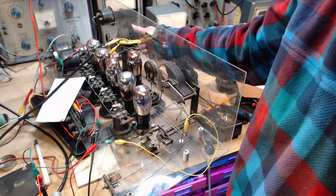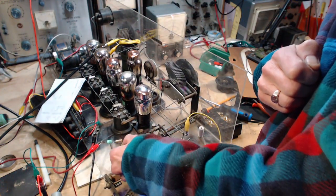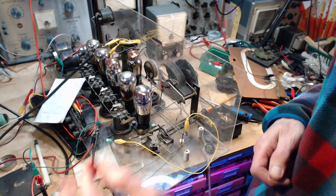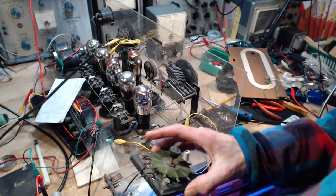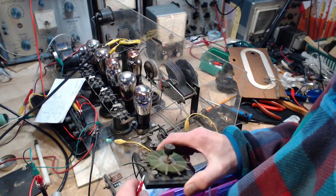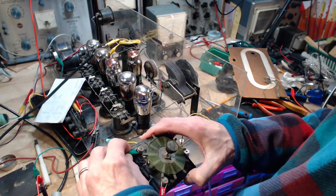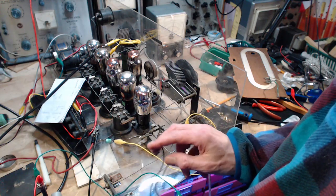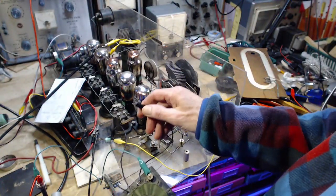It really seems like it can't get away from using that coil. So, you know, the loop antenna is very low impedance, so it's just shorting everything out here. So we really need to drive this through this coil, this as a transformer. I believe the normal way is come in here, come in here, and go out on these two. Our choice of where to put the local oscillator. Okay, so we also have a choice of this. This could go to the ground.